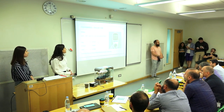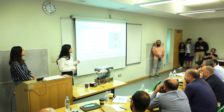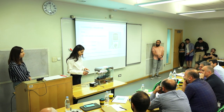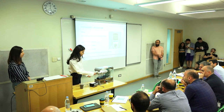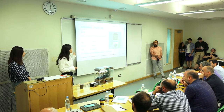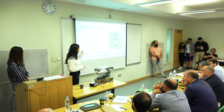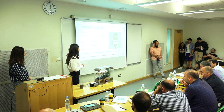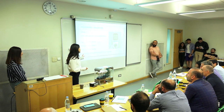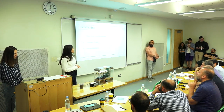So we had that the time needed for the heaters to reach these temperatures is approximately 18 minutes. And the time it takes for the pellets, and I forgot to mention that we use pellets from recycled ABS plastic, to be melted and extruded as filament is approximately 2 minutes. Based on our calculations, 1 kilogram of filament can be obtained in 5.3 hours, and 5.3 hours consumes 2.65 kilowatts of power. We also know that 1 kilowatt of power is approximately 50 drams, so we calculated the price, and for 1 kilogram of filament it is approximately 133 drams.